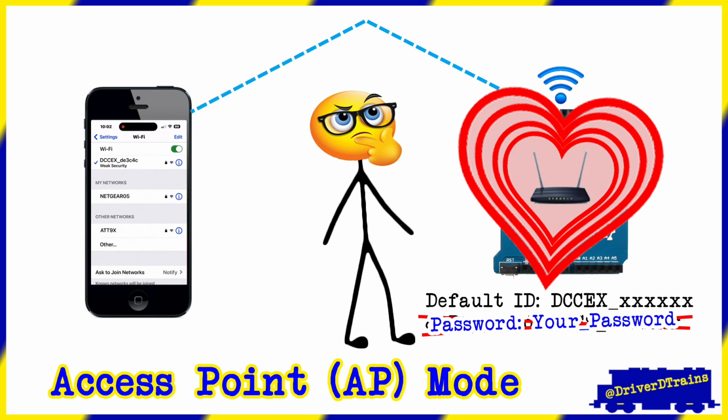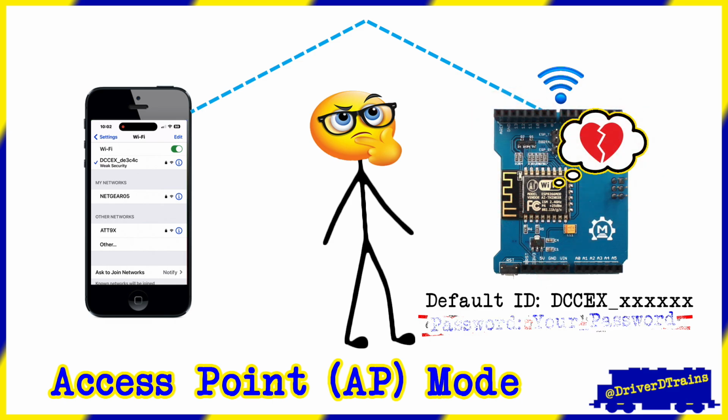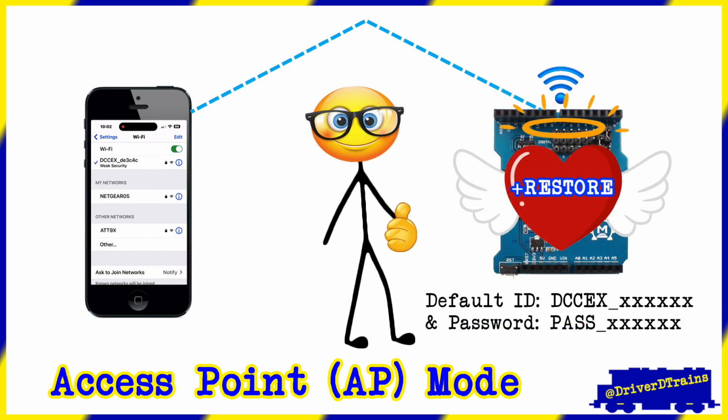So to truly reset the command station to access point mode, we need to erase the information stored in the Wi-Fi chip. We do this by sending the +restore command to the command station. Here's how.